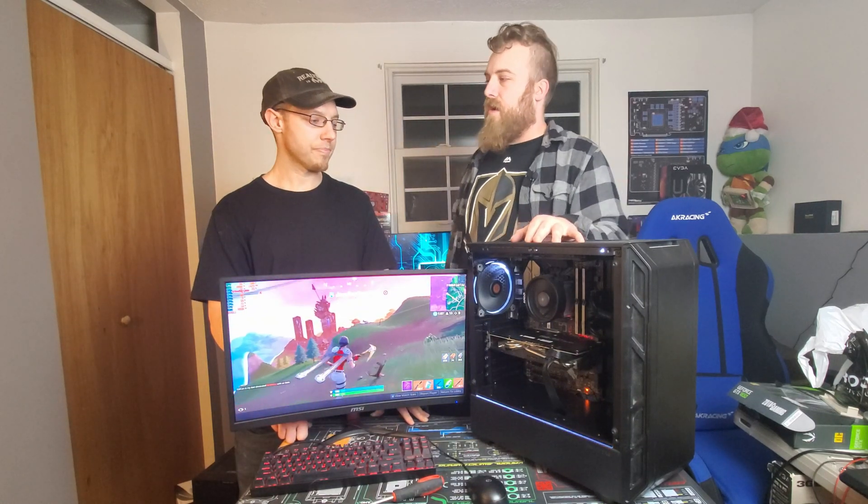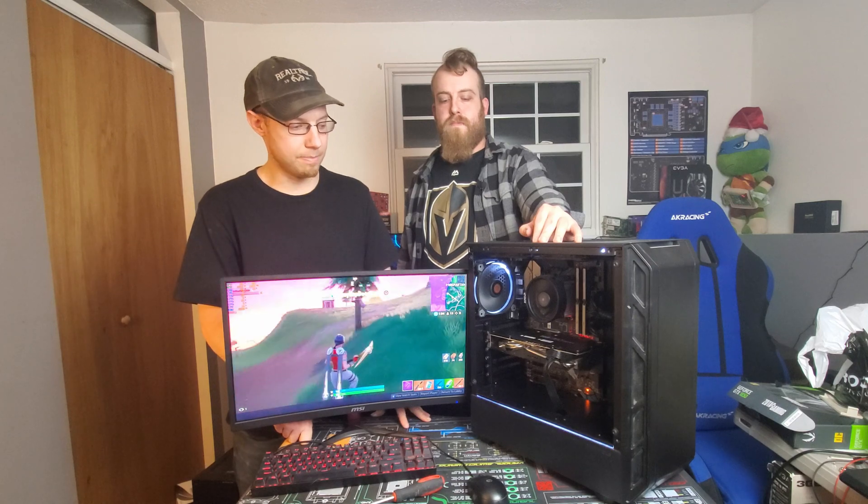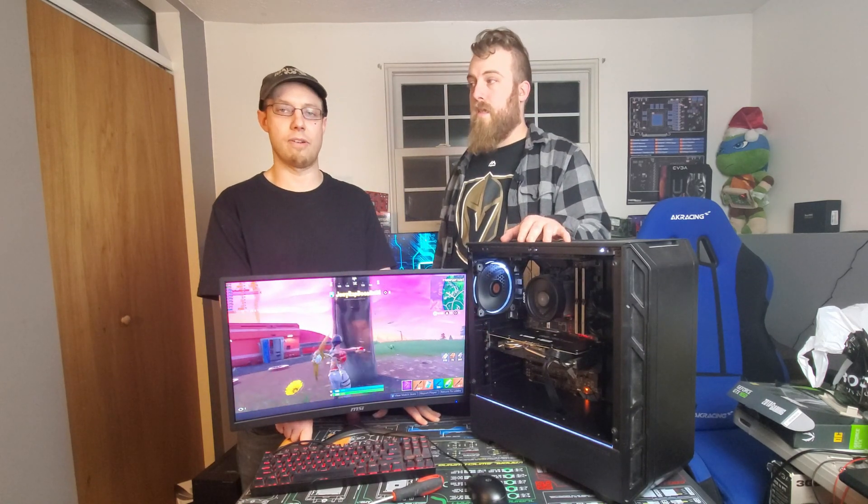That's what you're going to get when you buy old cards on eBay. When you first buy a used graphics card on eBay, plug it into your computer, make sure it boots up, then take it apart, change the thermal paste, and check to make sure no one did any crazy rework on it — no shenanigans. This card is also pretty power hungry — the minimum power requirement is 750 watts, which is quite a bit.